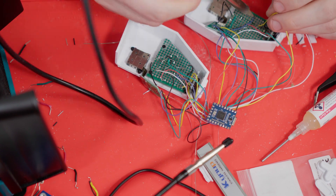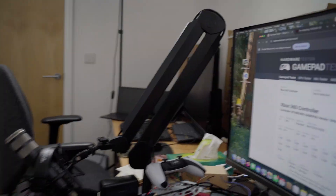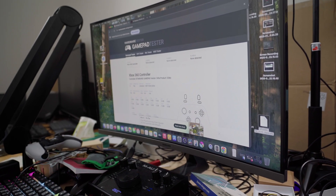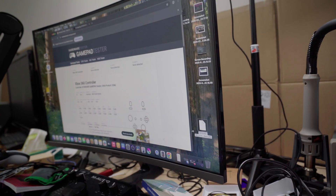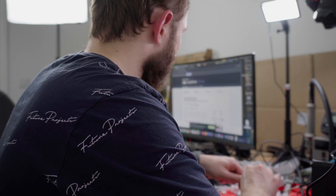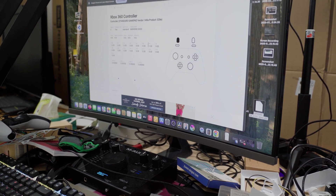Re-solder is what I did. It took a lot of time, so if I learned anything from this mistake, it's not to rely on my memory — check drawings, always. After that, it detected right away. The firmware has the pins configured in a certain way, but I had soldered the wires differently, so I had to reconfigure the pins. Now everything works. If I do a little test, you'll see the buttons all work. I just need to configure the joysticks — triggers work too.